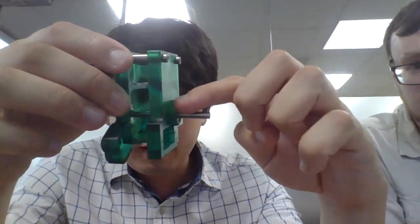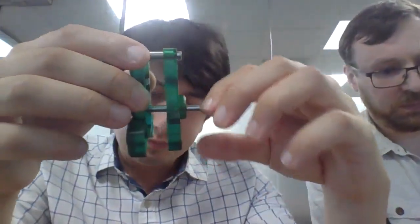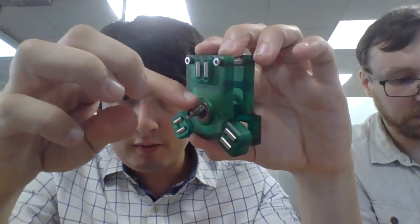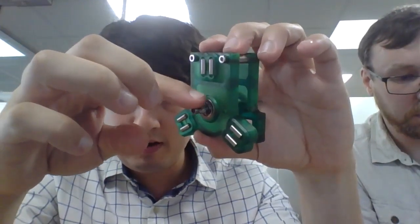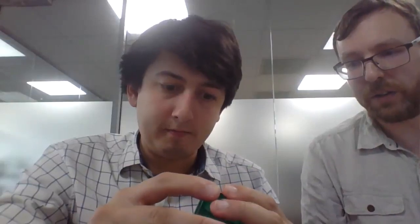To account for all of that, there's a thrust bearing that isn't in here but goes in here. And then there's axial bearings, flange bearings up front. The weird DMLS part has been changed for a nice simple cross pin that's retained by a grub screw. Yeah, Greg has helped. We'll just pop that. Oh, bits everywhere. Is that good on that, right? Yeah. So there's a little thrust bearing that goes in there. It's going to be a little bit thicker than that. We've only put it together for the demonstration.